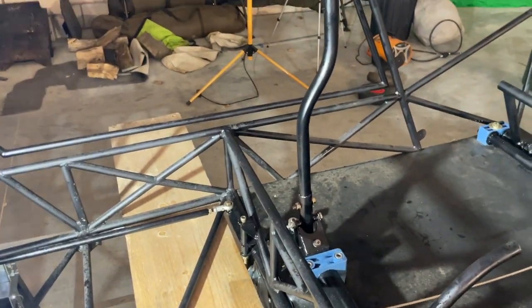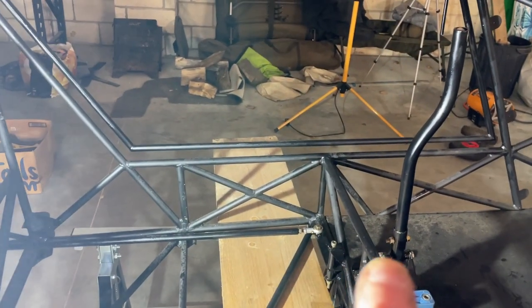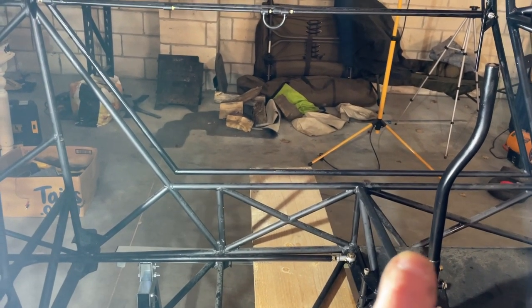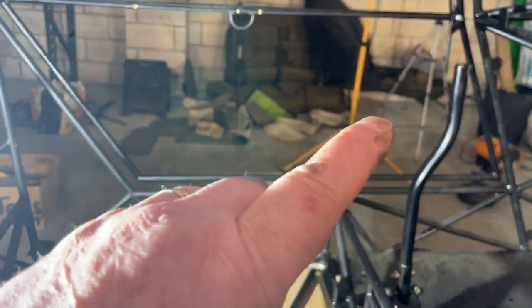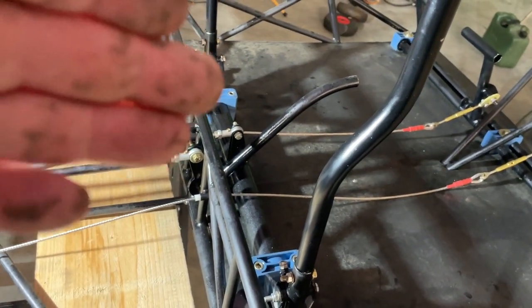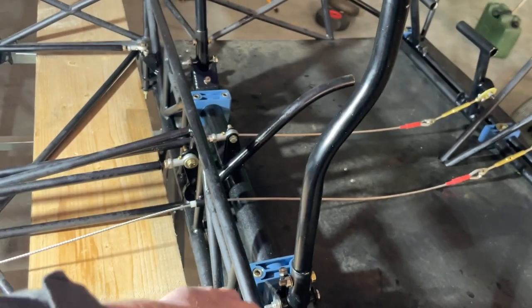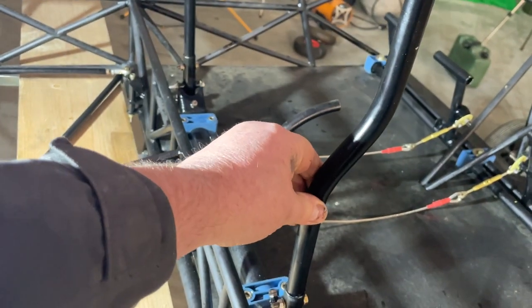The first one was drilled perfectly. They swapped round. It's just making sure that that hole was definitely perpendicular, because if it's out slightly, then when you twist it round and put the other one in, it will double the angle that you've drilled incorrectly. And that one was perfect. This one was slightly out. I mean slightly, but of course it doubles it. So if it was out by 2 degrees, you get a 4 degree variation. So what I did was I just opened out the hole on the control stick itself, just slotted each hole slightly, and that gave it a little bit of rotational play.